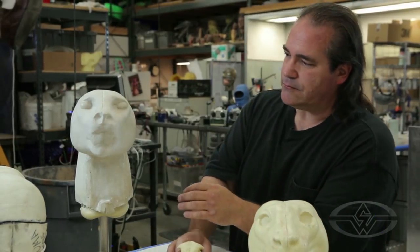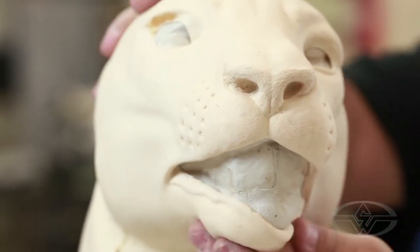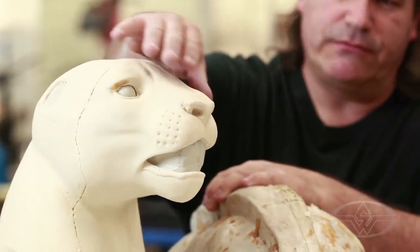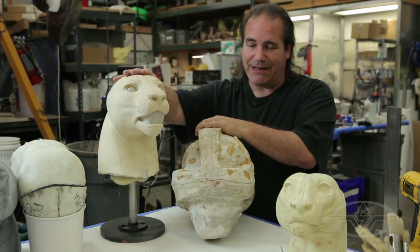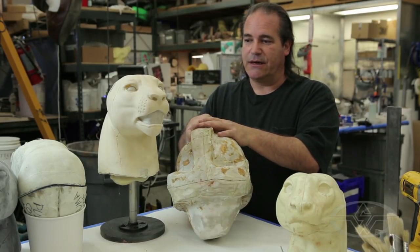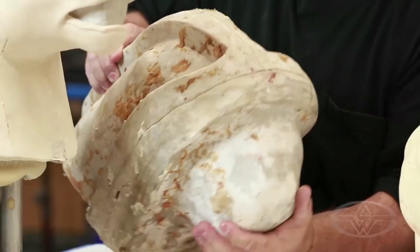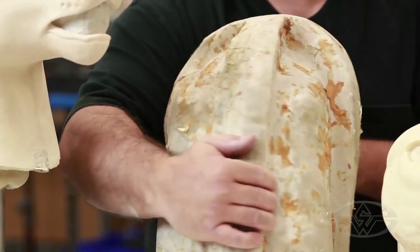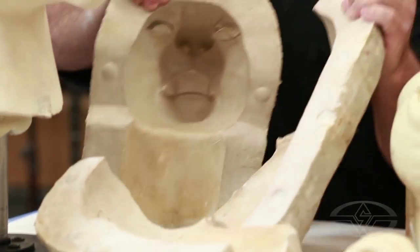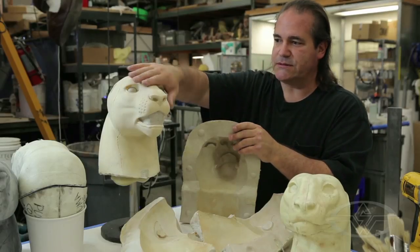We make a clay sculpture and I've got the foam latex piece already. That sculpture exists no longer because we've made a mold of it, but this is what the sculpture looked like when it was in clay. To get from the sculpture to the foam latex, we had to make a mold — a mold out of Ultracal, because it needs to be something that goes into the oven and bakes to get the foam latex. Here's our Ultracal mold of the puma head and it's a three-part mold. You open that up and there's the inside of the mold. From this mold, we produce the foam latex skin.